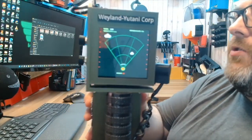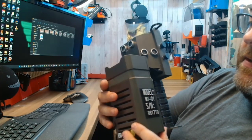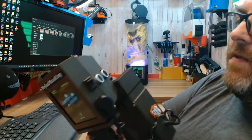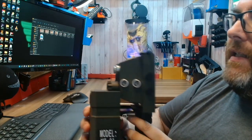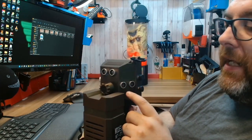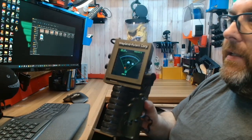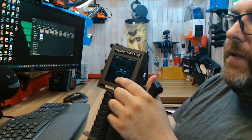Here's a close-up of the tracker that we built. It's a 3D printed chassis using Prusa Mystic Green filament — it gives it a nice colour change that doesn't really translate well on camera but up close it's pretty nice. It's got a Raspberry Pi for the brain, three HC-SR04 sensors to do the distance measuring, and a buzzer that beeps every time the scan line comes up and down the screen.